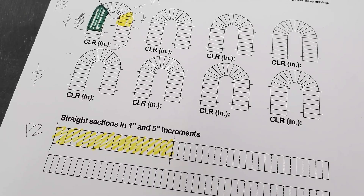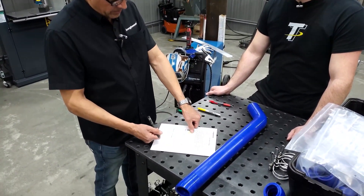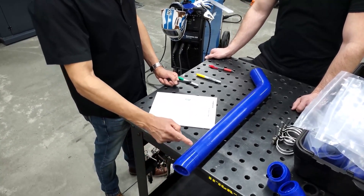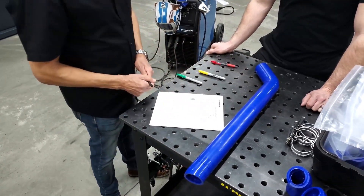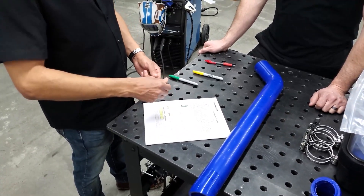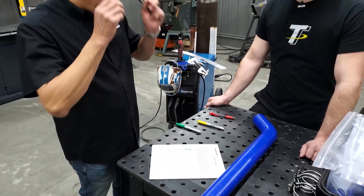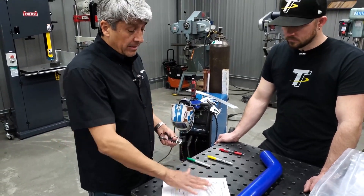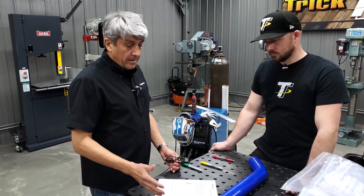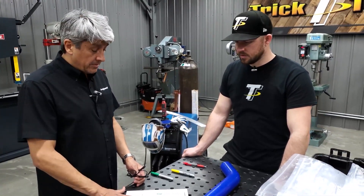We have one U-bend, a chunk of 20 inches of straight, and we can determine that each part requires two cuts — three parts means six cuts total — and then one, two, three, four welds. The whole point of the control sheet is to determine exactly what it will take to build this and confirm it still makes sense before pulling the trigger. This is what saves a lot of time and material, avoiding useless scrap, and you can knock this out in a matter of minutes. Let's move on to the cutting stage.